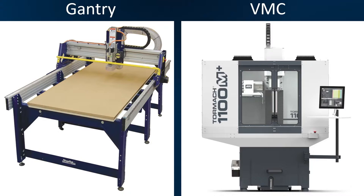Why is that? The VMCs are designed to be extremely rigid. They're designed to get a thousandth of an inch level tolerances on metal parts. To do that, they have to be very, very rigid. When you go to cut something, there's a reactive force pushing back against the cutter. You need to make sure the cutter doesn't move or deflect, or minimize the deflection as much as possible. The VMCs are very big and very heavy in order to accomplish that goal.